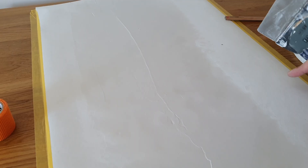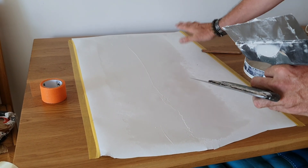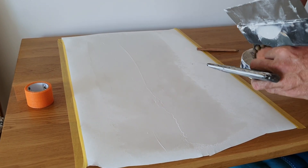Just get these little snots off — these are as good as it gets. Now we can let the wall dry, rub it down with some sandpaper, wipe it off with a damp cloth, and it's ready for painting.